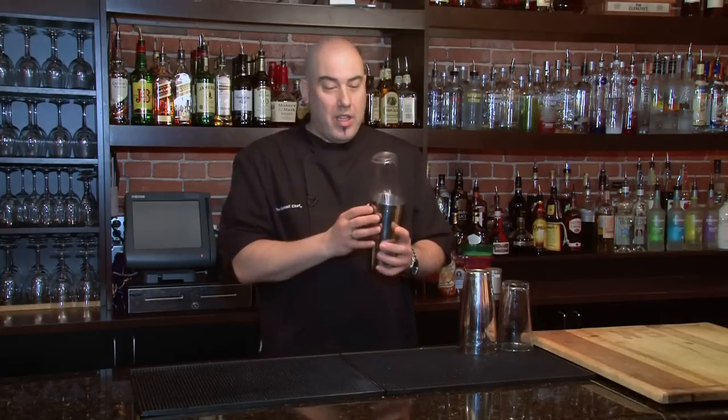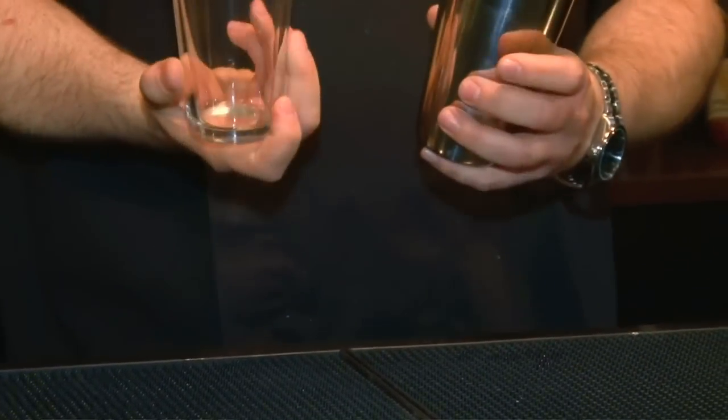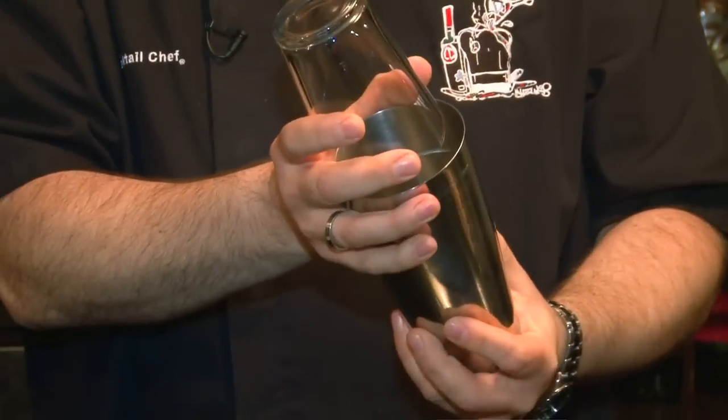When you do that, do not tap the side that's flush against the glass because you may break the glass. What you want to do is take the side that has a gap and tap it that way, rocking it forward at the same time. It's a gentle motion, and that rocks it out of place and now frees itself.